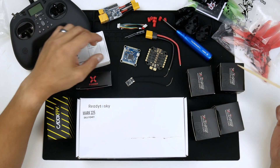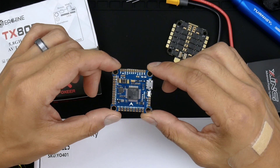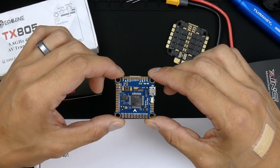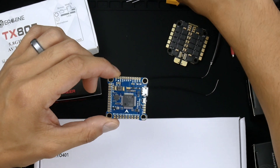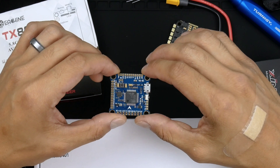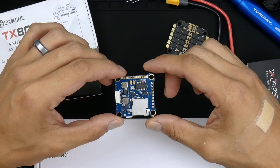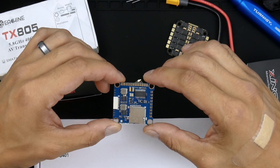Next is the Omnibus F4 V3S Plus flight controller. It has an STM32 F4 processor. It comes with on-screen display support, which most flight controllers these days essentially have. It has a built-in barometer, which enables you to see the altitude of the quad in the on-screen display while you're flying. It uses the standard 30.5mm mounting and comes with rubber gummies so that when you mount it onto the frame, it absorbs vibrations and reduces them so they stop affecting the gyros. It also comes with an SD slot for black box recording, which is very handy for fine-tuning your PIDs or diagnosing any ESC or motor problems when you start flying.